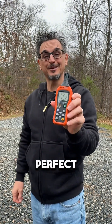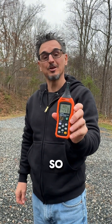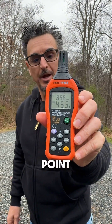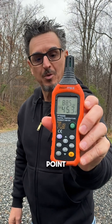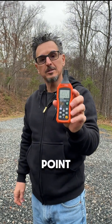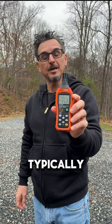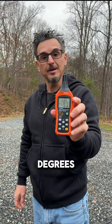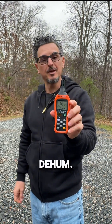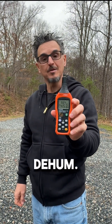This is the perfect day to demonstrate how makeup air units work. The first thing we do in an MAU is look at the dew point. If the dew point is below the dew point set point — right now the dew point is about 45 degrees — the dew point set point on makeup air units is typically around 50 to 55 degrees. So we're below that set point, meaning we would not be in dehumidification mode.